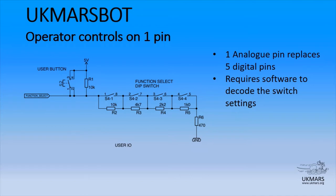We've also got an extra push button — switch two — which works fine. But you need to be aware that you cannot read all of the DIP switches while that push button is pressed, because the push button is pulling that input up to five volts VCC.